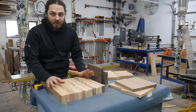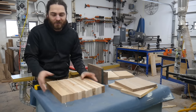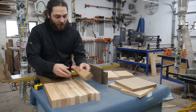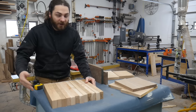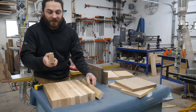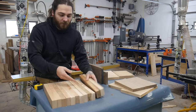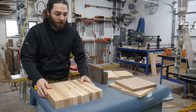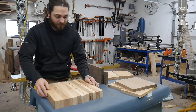I'm not gonna go too deep into milling — hopefully you understand the basics of getting your lumber flat. I cut them into a bunch of two-inch strips and plane them down to get them nice and even for a glue-up. This is one way to achieve thicker wood: you just cut them into as thick a piece as you want. Being a bunch of individual pieces like this, it'll be pretty stable and not very likely to warp, which is why people make thicker cutting boards in edge grain orientation.